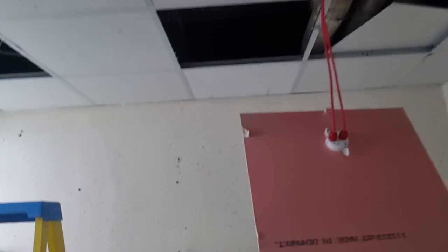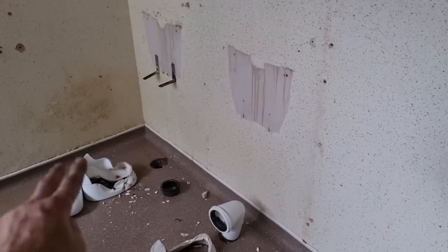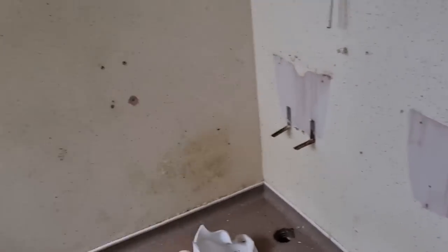All the heating is two-and-a-half inch — although that is galve, I'll be surprised if that's heating. On the other side of that wall somebody's taken it to copper and there are two lever valves, so that radiator just comes off. All these are being ripped out. The worst bit will be getting the floor chopped up to get a new drain out. I'm loving the cable-tie pipe clips. All these toilets were trashed — the systems were all broken, just stuck back together. It was a right mess. It obviously hasn't been looked after the best.